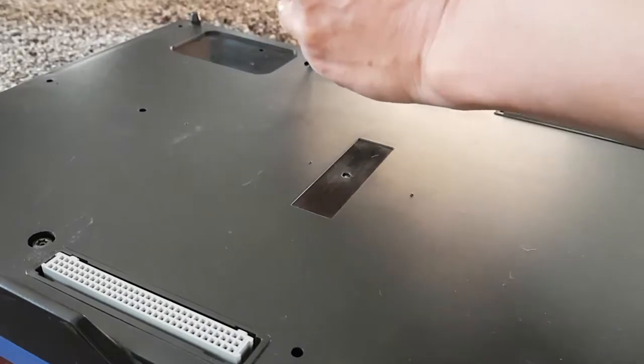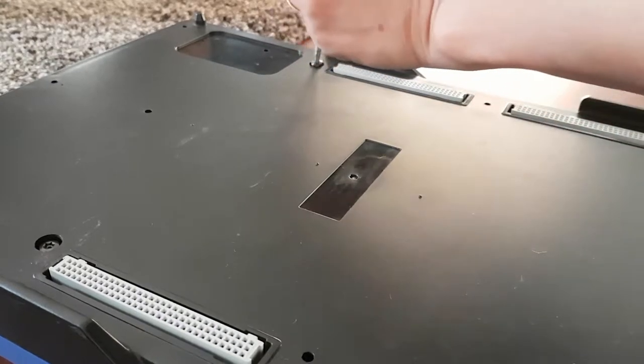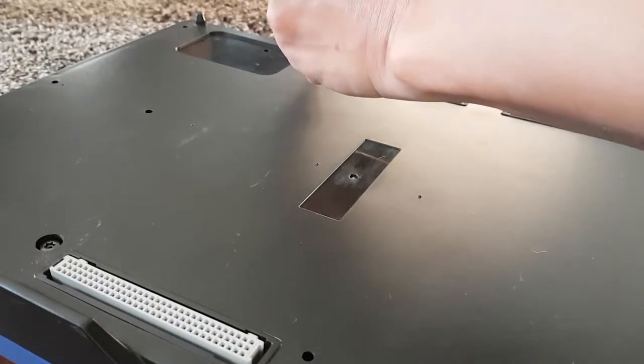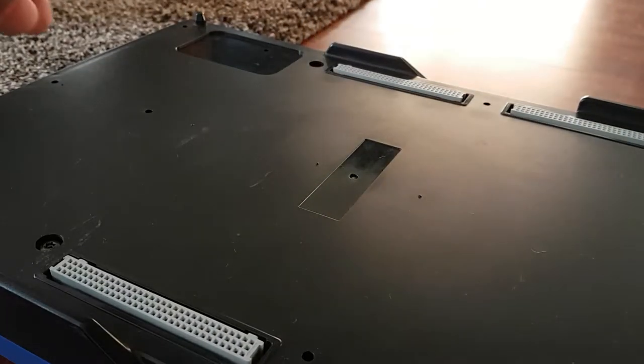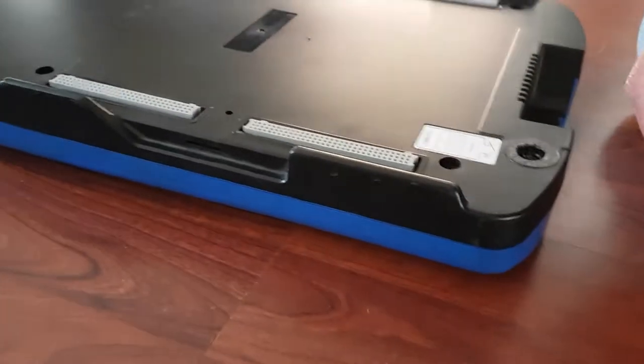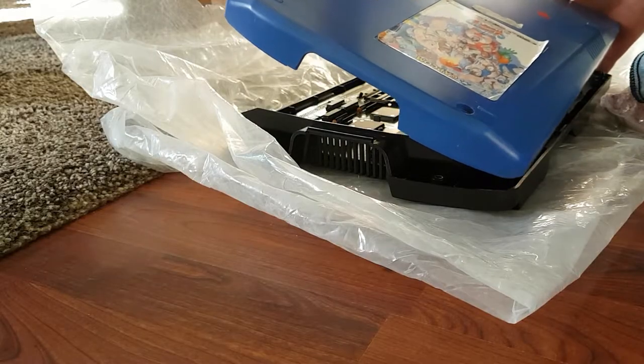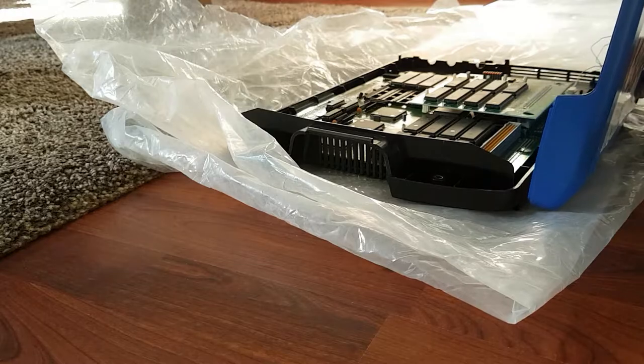In this house where I'm actually doing this, I wasn't fortunate enough to have a workbench or anything, so I'm carrying this out on the floor in the front lounge. It's a wooden floor, so I'm performing this on the rug just in case unwanted static electricity will destroy the arcade PCB and ROMs.